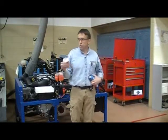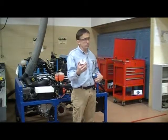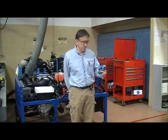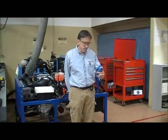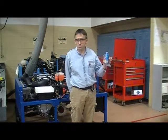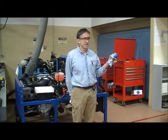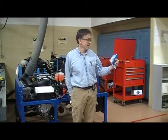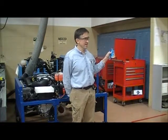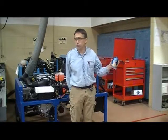All containers — you all need to buy pure R134a. It'll say R134 refrigerant and won't say it has anything extra. But if it has something like this — this is Arctic Freeze, ultra synthetic, colder air up to 50% faster, advanced leak sealant — that sounds really good, doesn't it? I have a can of this that somebody brought me, and on the side of it I have a piece of tape that says 'do not use,' because I don't want you to put this in anything. I have it just for you to look at. Don't use this in the vehicles that you all work on or your own vehicles.